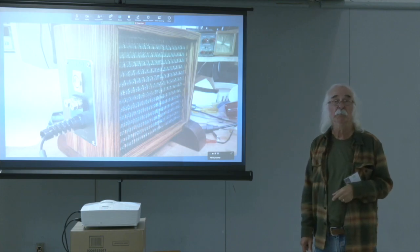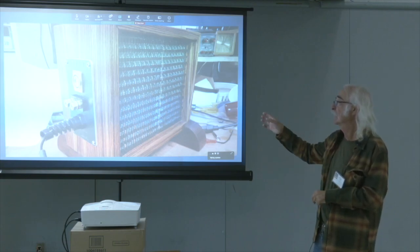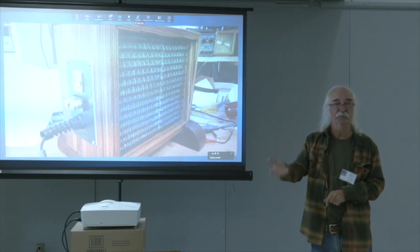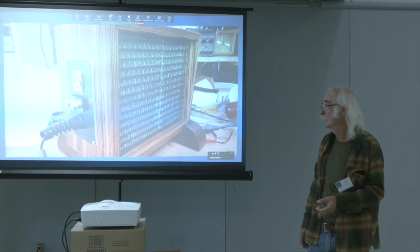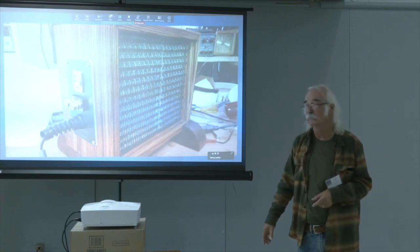And it worked quite well. It is, however, not a push-pull design. It is a single-ended Class A. Half the JFETs are run as constant current sources, and the others just simply follow the signal. Kind of like this inductor, except that instead of the big coil, you have another half of the outputs operating as a constant current source.